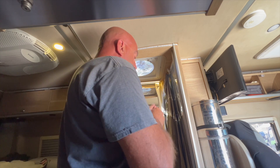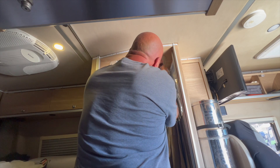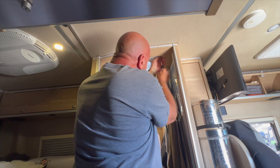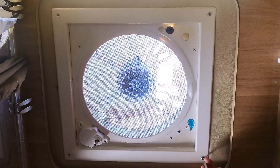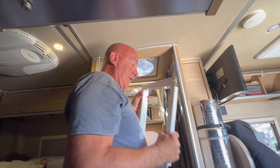A tip I have is using a magnetic tray to keep all the screws so I don't lose them. Next, I'm going to remove the fuse so it's not hooked up electrically — it just unscrews like that. Then remove the four screws in the corners of the housing. I prefer not to use power tools here because you're going into plastic and wood and it's very easy to strip out the threading — old school hand tools.